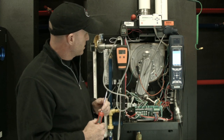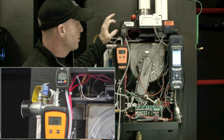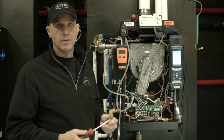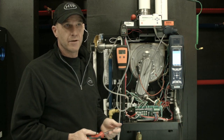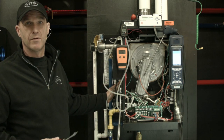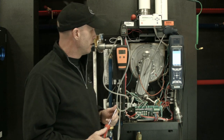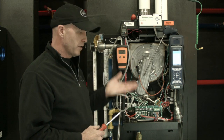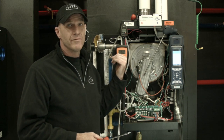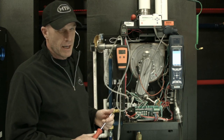We're sitting here at about 7.7 inches of water column. Manifold pressure is something we read in low fire only and typically runs in a negative. Depending on the gas you're using, that negative pressure can change. It is also listed on the side of the boiler for reference. We want to run a simple test to look at static and dynamic pressures. Static would be sitting here at 7.7 inches — we're going to run it through a test and see if we adhere to that ½-inch pressure drop.